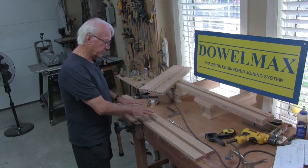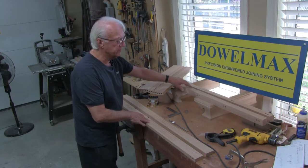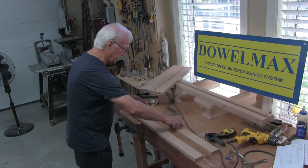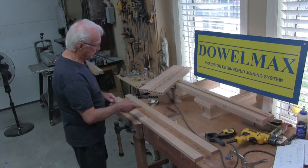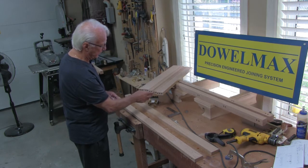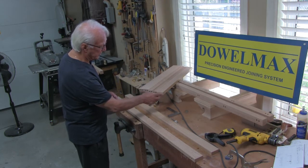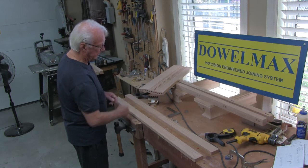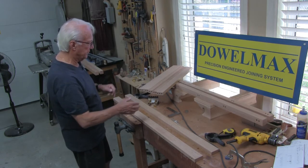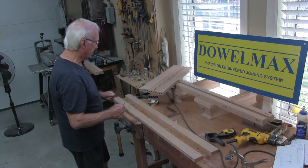Now, in this design, there are two inner verticals, as I call them, which are the same length and attached to the interface of the two front corner posts. A range between these inner verticals are four rails of different widths. This is the top rail, which allows for four dowels. These are the two intermediate rails, which are adjacent to the drawers, and these are two dowels each. And this is the bottom rail, which is two and an eighth wide and has room for three. Now, the back, for structural purposes and also because of the drawer arrangement, is identical, so that's a good feature.